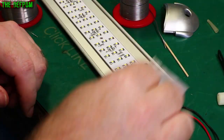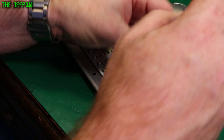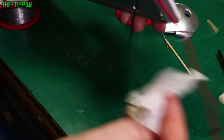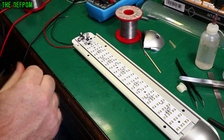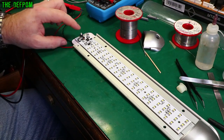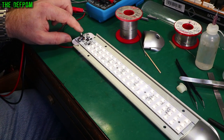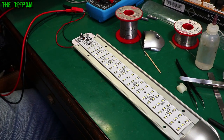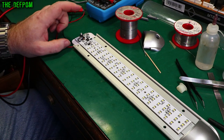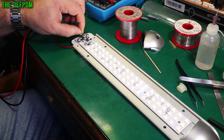Okay, let's clean this up. Flux everywhere. Right, moment of truth — let's hook this up to power and see if it works this time. Yeah, look at that. It's not great though. That's doing 300 milliamps at 12 volts. This runs on a 24-volt system, so winding up to 24 volts it's more like 26 volts most of the time. That's 185 milliamps. Let's switch and see — it's just not good, is it?